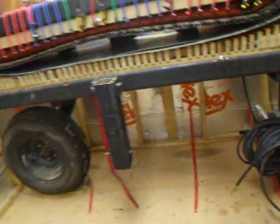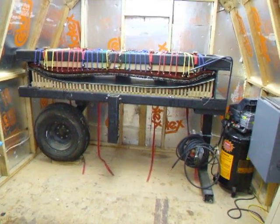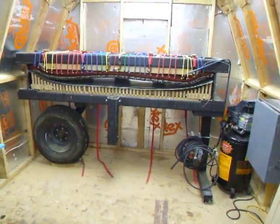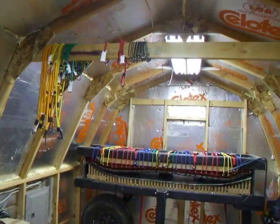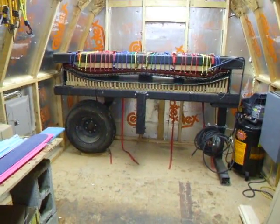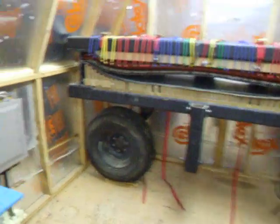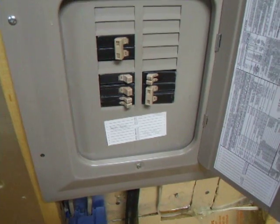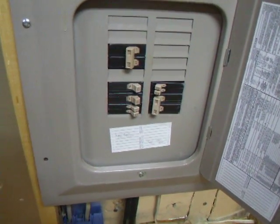As far as the rest of the shop is concerned, I'm mainly putting this up to get rid of the press, but maybe I'm looking at moving locations. This entire shop is certainly not up to electrical code, but I wired everything myself, and again, I've never had troubles. There are 2 layers of insulation on the ceiling, great for epoxy work in here, because you can ventilate it if you so desire, which is probably a good idea. It's really easy to keep warm in here with a couple of space heaters, even up to 100 degrees. We're pulling 60 amps into here, with a fuse panel where both the heat blanket and the air compressor run on 240 volt mains, and everything else is 110 with a couple of outlets against the wall.